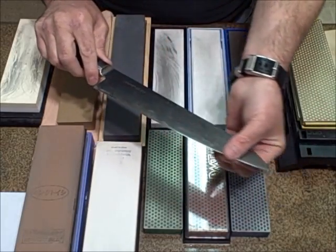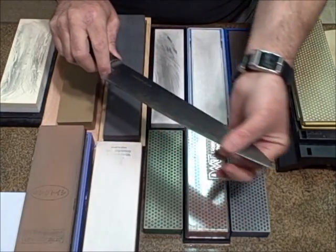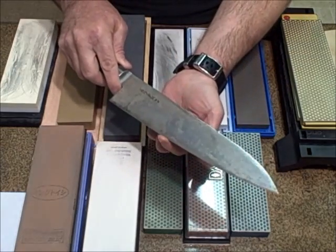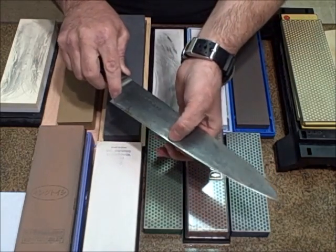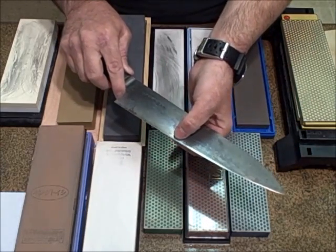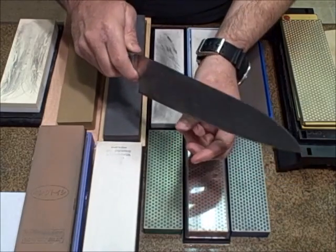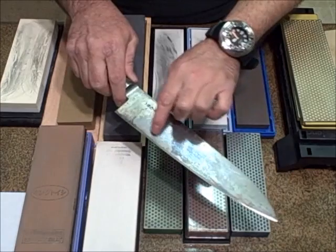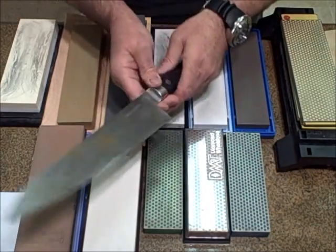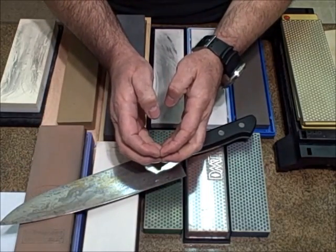The ideal is that you want the blade to be thin enough, at any angle, yet thick enough. When I mean thick enough, I mean the back bevel that supports the primary cutting edge, that grind that you see on knives. You want that back bevel to be thick enough to support the chore that's going to be appointed to this primary cutting edge. If that back bevel is too thin, the primary cutting edge doesn't last and the edge will roll over from one side to the other, or that edge will become rounded again.